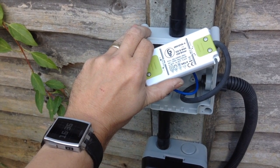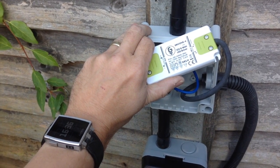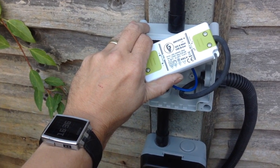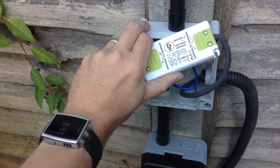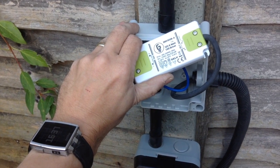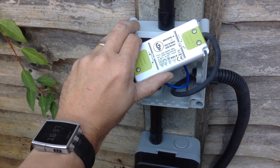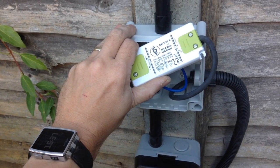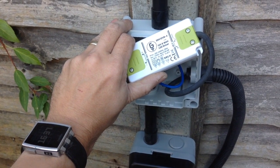At the other end of the DC cable we're going to need an LED driver to convert the 230 volts coming in down to 12 volts DC to drive our 12 volt MR11, G4, or whatever type lamp. And that's what we've got here — it's a transformer which is going to sit inside this IP-rated box. Hopefully the water will stay away from it if the IP rating of the box is maintained, and that will give us our low voltage output over to the bollard across the other side of the patio. So even if water gets into it or it gets damaged or someone starts kicking lumps out of it, there's no chance of it causing anything to trip and no chance of anybody getting a shock.